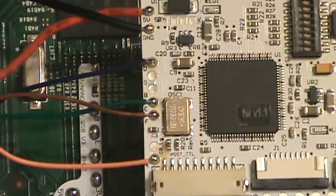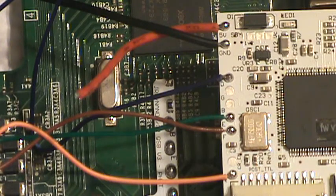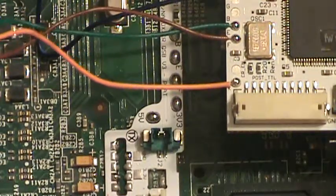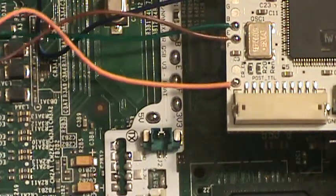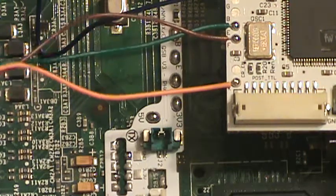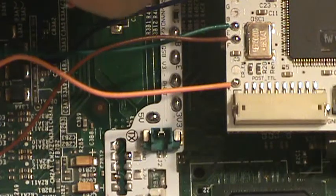Now it's time to clean them up. Now that we've got all the wires attached, this next part is for the most part fairly self-explanatory. Some of the wires are a little bit extra in length — such as our orange wire and our green wire, they both need to be trimmed down. We can trim the orange and green wires down to the same length as the brown wire. We want it to be a little bit long because it's got to sit on top of the DVD drive.